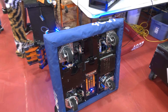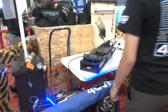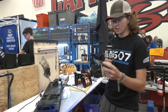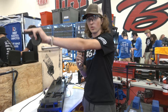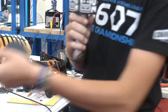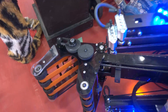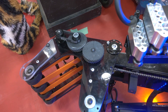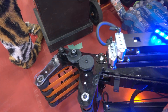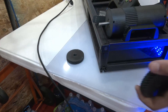Let's talk about some 3D printing on your robot. Isaac is going to be covering more about that. So talk to me about what you've done for 3D printing. For 3D printing, we wanted to utilize it a lot more this year to keep the end out there light because it's going to be hanging way out over the nose. So we actually print carbon fiber nylon. For our intake over there, you can see that the gears are actually helical gears, which have multiple benefits. The V pattern keeps them in line with each other, allows no backlash, and more power transmission so they can survive more. Those gears have been on there the whole season — we have not had to replace them at all — and they're printed out of carbon fiber nylon.